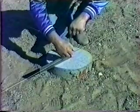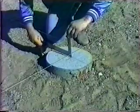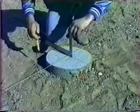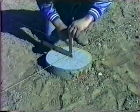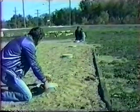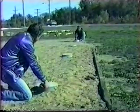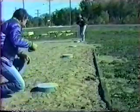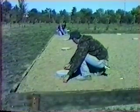Lay the building out on the piers by marking them from the lines you established with your batter boards. This type of organization is time very well spent. Snap chalk lines from your marks to show where they cross the piers. We will later set the panels on these chalk lines. It is a lot easier to square things up when there is nothing in the way. As is always the case, a good beginning is half the battle.